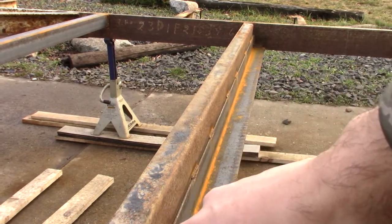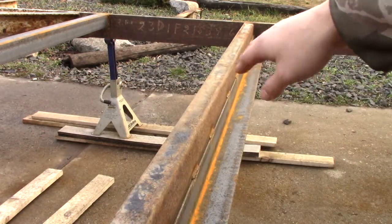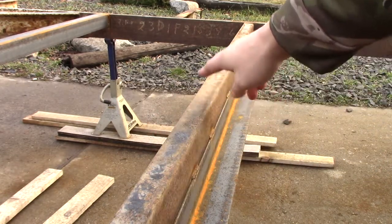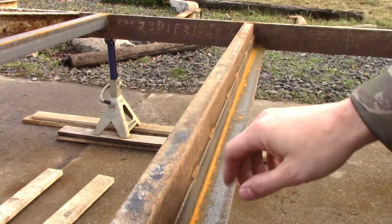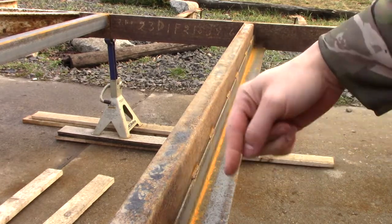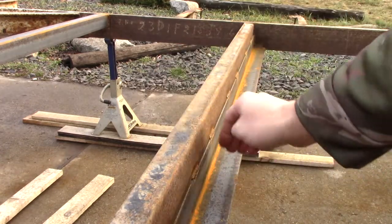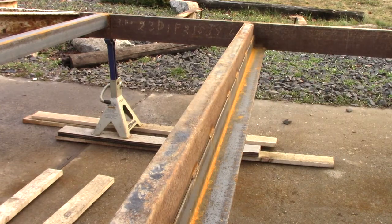Here on the inside of the frame — this is one of the frame cross members that goes between the two frame rails. There's one right here and another one over there. Same issue: very thin sixteenth-inch angle. When I first got the floor off, if I stood on it, it would completely torque out of position — distorting really badly. So I took the same eighth-inch angle, ground it down to a super snug fit between the frame rails, and tapped it in with a hammer on each end. Same homemade Z-channel result — it went from flexing wildly to barely moving under my full body weight.